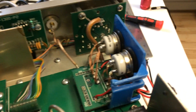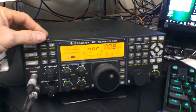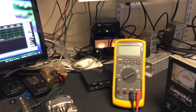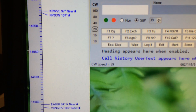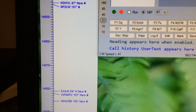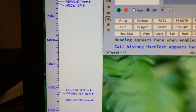You can see the relays here. Let's see if I can focus in there. I've got some pictures on the Yahoo! Groups. I've got the amplifier and I'm just driving it with the K3. Right now, just to show you, the transmit delay on the K3 is as fast as it can go — add 8 milliseconds. We're going to do a little QSK at 41 words a minute. I've got WinKeyer set up for 41 words a minute. I regularly run in the mid-30s, like in the CWTs. So 41 would be, maybe if I was on the DX end of a pileup or something — I'm probably not going to go that fast. But 34 to 37, I do all the time.